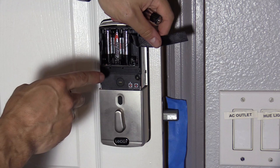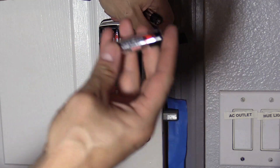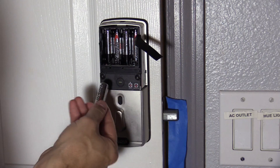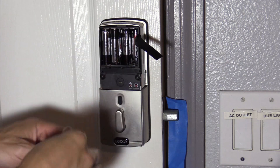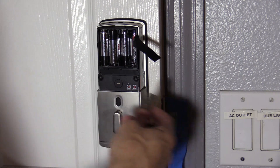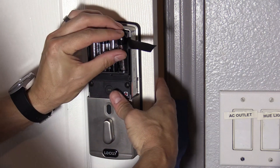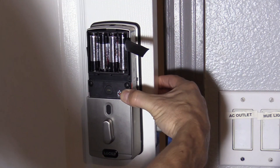I noticed that using lithium batteries can cause the lock to malfunction, so I highly suggest using Energizer batteries. I tend to use rechargeable batteries because I go through the batteries every six months. Once you put in the fourth battery, you should hear a beep, then go ahead and put the remaining batteries in. Make sure the deadbolt is not resting against the door frame as it could impede the testing process. Once you put in the last battery, press and hold the program button — you'll hear beeping, then release.